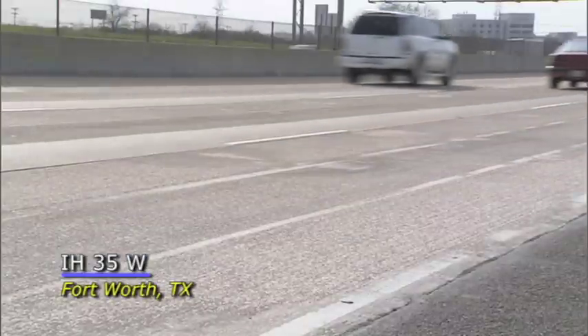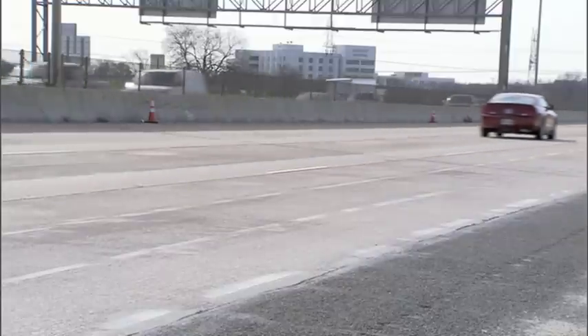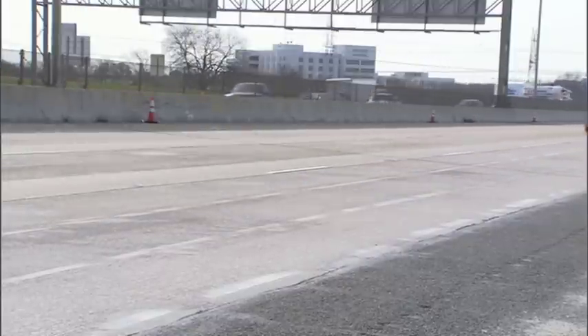The problem was the surface friction, or lack thereof, on the pavement surface, so we're trying to restore and increase that surface friction. What was planned for all of these sections was a thin overlay of hot mix over that concrete pavement. This is pavement in an urban area, so anytime you have an overlay you're affecting your vertical clearances with any bridges that go over that facility, which we have a few. We don't have that issue with this process, but we have potential for that issue with an overlay.